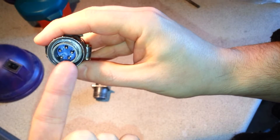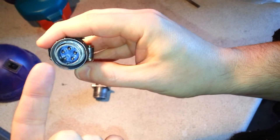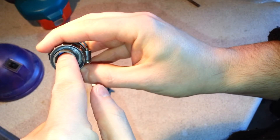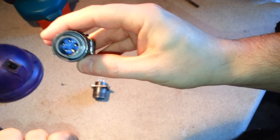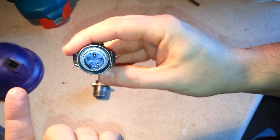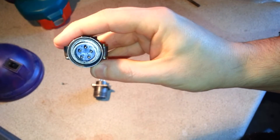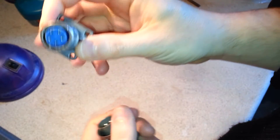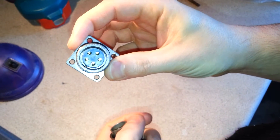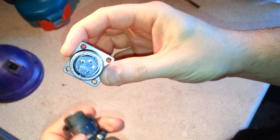So you've maybe got 80 volts across there, 70-80 volts, or if it's for the spindle 220-230 volts, and you can stick your finger in at any point. Now it's probably not going to kill you unless you're really well earthed, because it will just blow the end of your finger off, but it is certainly going to hurt. So making the socket female is definitely something you want to do.